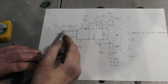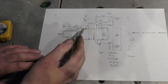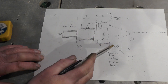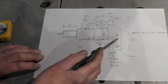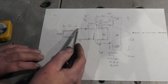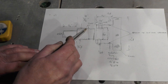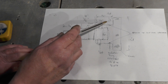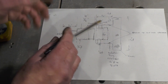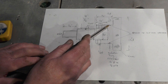I've made a bit of a SketchUp — I'll show you. This is the extension piece I've put on my lead screw with two flats on, and it just screws into the lead screw and stays on permanently. Then I'm going to make this handle with a knurl finish like I've put on my saddle handle to match. It'll be bored out to fit over the extension piece with two thumb screws to clamp it on. Then I'll make a dial — shown as a dotted line here — that slides onto the handle, can rotate to zero it, and locks with a friction screw in a groove in the handle.